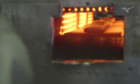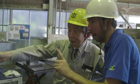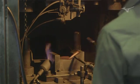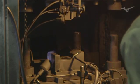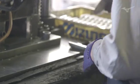From there, it takes the primary forging and it goes into the first set of precision forging. So this is the first time precision forging. Precision forging is a hydraulic press that's a slow compression of the golf club into a more precise shape. There's a little bit of extra flash that comes out after a precision forging. That's removed through another cookie cutter, and then it goes into the secondary forging. Again, each of these steps is tightening the grains, making sure everything's really consistent, and pressing it more and more into the shape of a club.